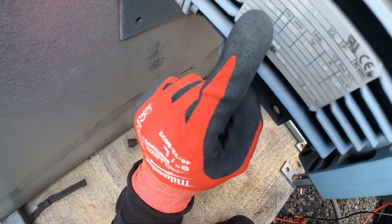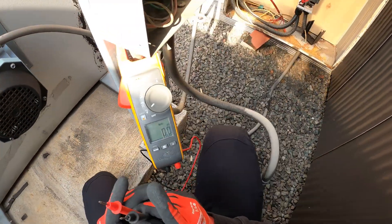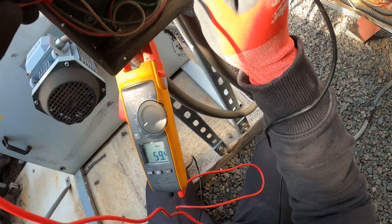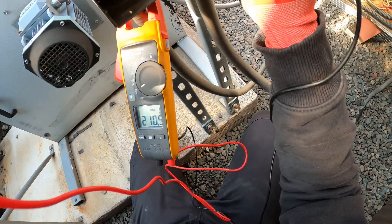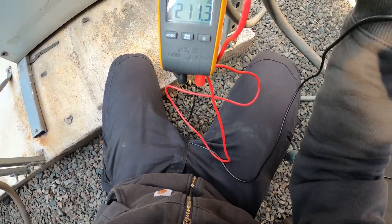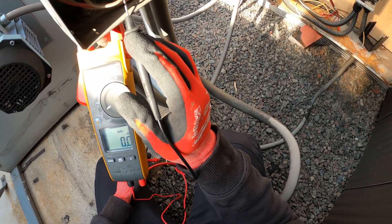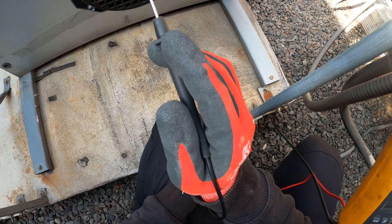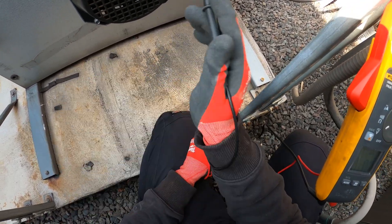What's going on here is that this motor is only rated for one voltage: 440 to 480 volts. Let's pay attention to my meter. This is a three-phase system, so let's go across the first two legs — we have 212 volts. Across the next two: 210 volts. And 211 volts. So we're only getting 208 volts three-phase but we have a 440 volt motor. This is being supplied under voltage — it's only getting 208 volts when it needs 440 to 460 to spin correctly.